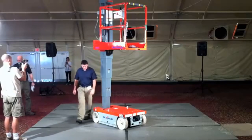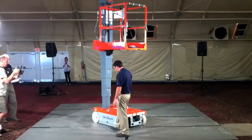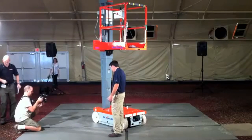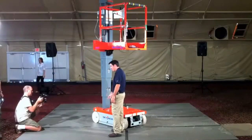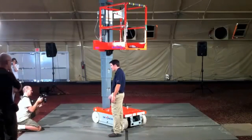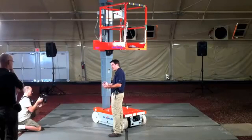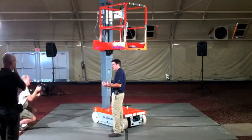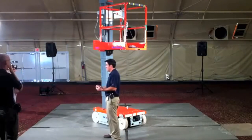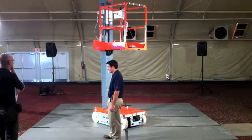The pothole system, conventional, as you can see now that the machine's up, conventional drop-down type pothole going the full length of the machine. It folds up underneath. And you can forklift from the side. There's no forklift pockets on this machine, but we've designed it so that you can fork from the side. And there are bars that rest about 1/8 of an inch lower than the pothole, just in case you end up messing with the pothole system. So a little bit of added protection there.